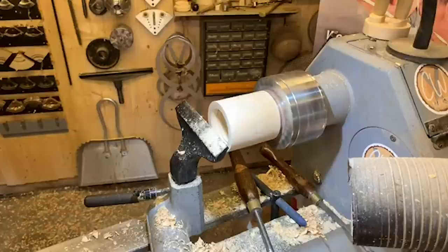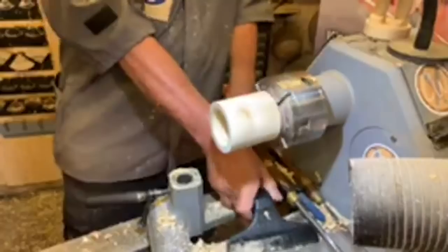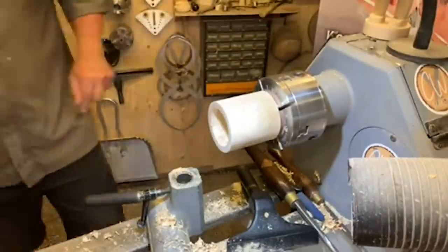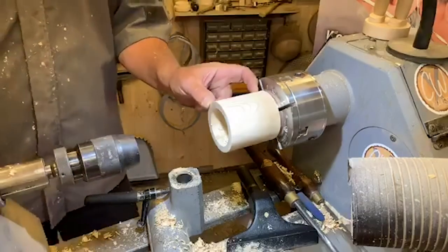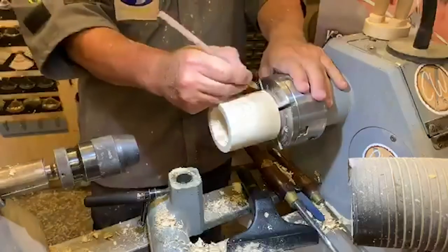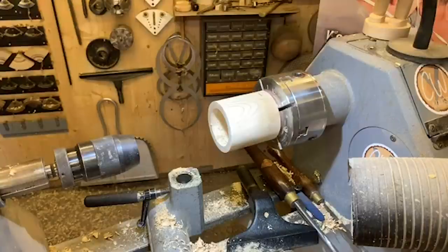There's the bottom of the hole. We'll stop the lathe and have a look. We might want to slightly refine that shape. 55 minutes in. I'm not going to mess around with that anymore — we can sand it now of course. I'd like it to be a little bit more bulbous on the inside, a little bit wider, but we're running low on time. We're going to carry on. I can now turn that over. It won't fit in jaws as is, so we might have to go back to our OD 112s. There's pretty much a jaw to suit most sizes, and if nothing fits, go to a wooden friction chuck — that would work best.